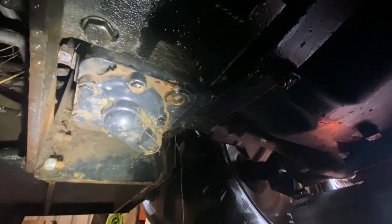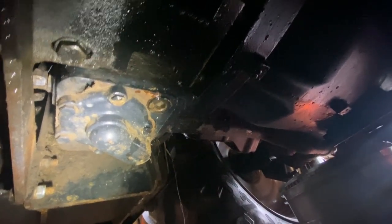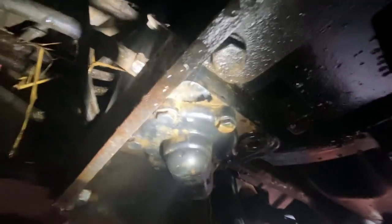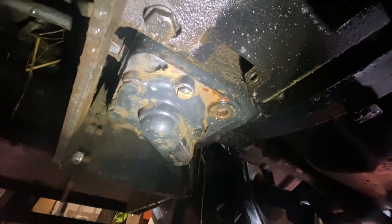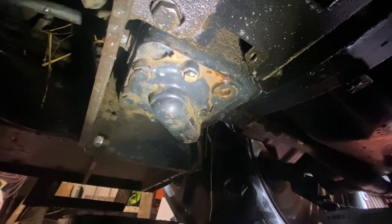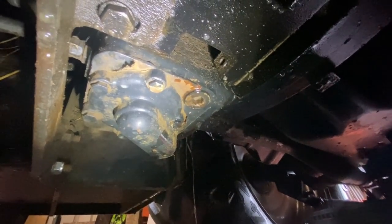Now we'll drop the hydraulic oil and check that. Here we have our tank filter — it's directly at the front of our hydraulic tank. All it does is when you fill up with oil, it catches any debris that's in your jug or that falls in. I can see by the bolts that this filter has never been taken off, so I'm expecting it to be a bit dirty. We'll whip it off and clean it out. Right, I've got the tank filter out now, and as you can see it is fairly clogged. I thought I had a spare but I can't lay my hands on it — it may have been used in another tractor.